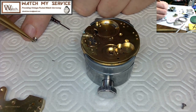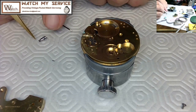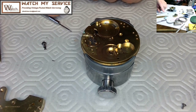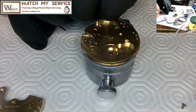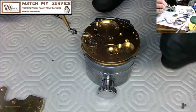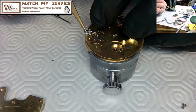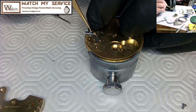I'm putting the main post inside the setting mechanism — I believe it's the ratchet or click crown wheel. When the crown is pushed down, that little post is pushed out, engaging the winding mode. When you pull the crown out on this pocket watch, you're setting the time. So it's the setting mechanism that distinguishes winding position from time-setting position.